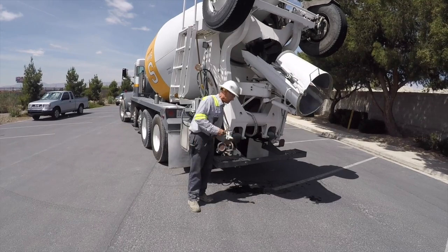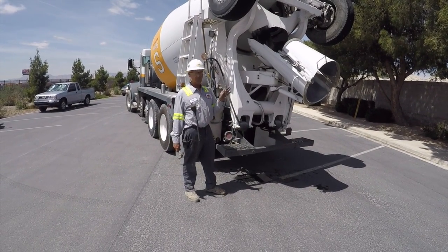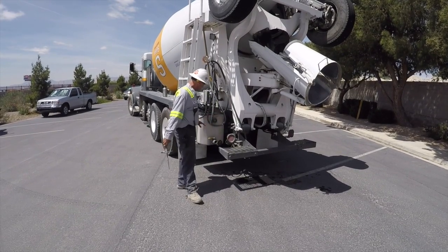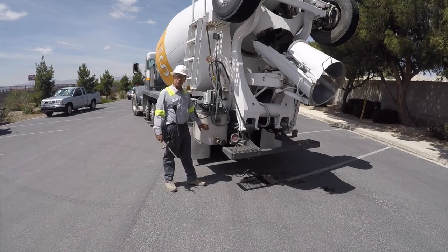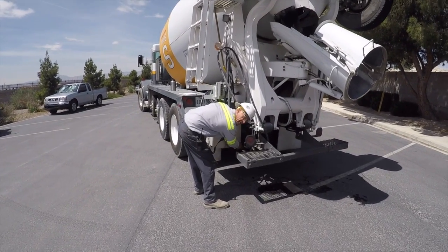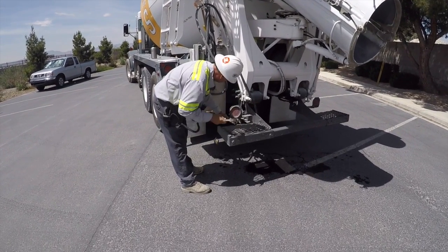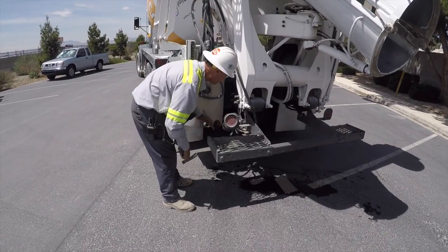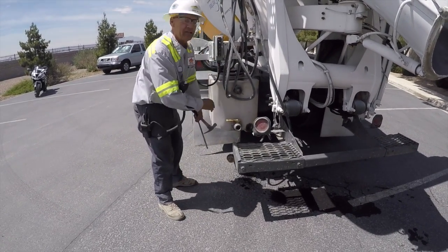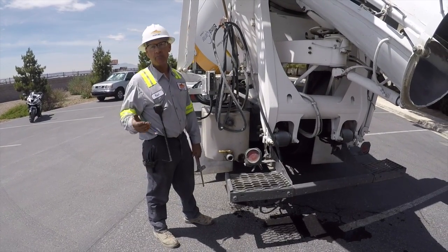In my toolbox I like to carry a hammer — you can carry a screwdriver. Right here I've got a piece of rebar that I picked up on the job. So for instance, if you forgot to empty this, you could go ahead and take the plug out before you go to get loaded, knock a little hole in here, drain out the water, give it a few taps, get it cleaned out enough to go ahead and get loaded. Then you can clean it up better later.